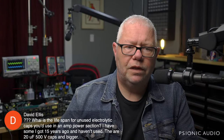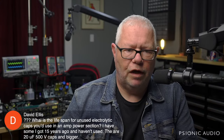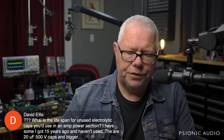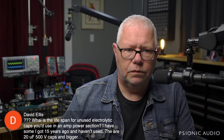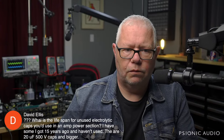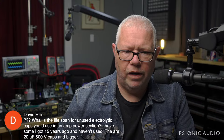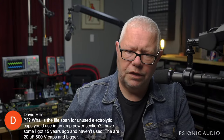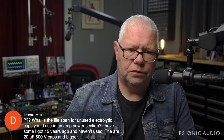David Ellis, you're pretty much approaching the lifespan at 15 years if they haven't been used, if they're just sitting around. Caps dry out, the electrolytic dries up, and no longer does what it's supposed to. So don't put those in an amp. That's a case where you can try reforming it, bring it up very slowly on a variac, and then testing them afterwards. The worst thing you can do to any capacitor is to let it sit around unused.